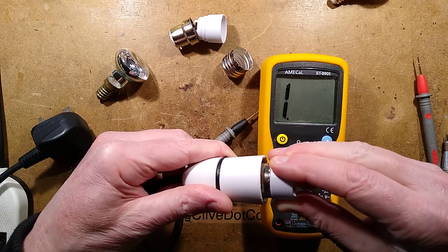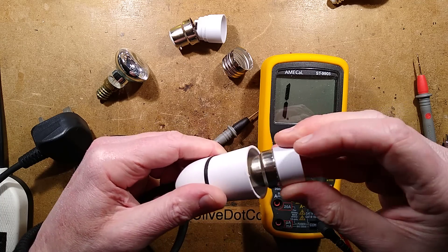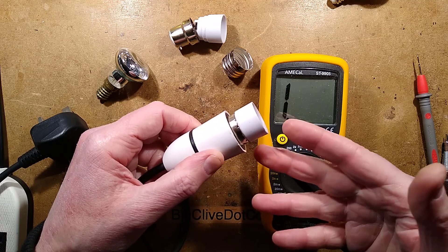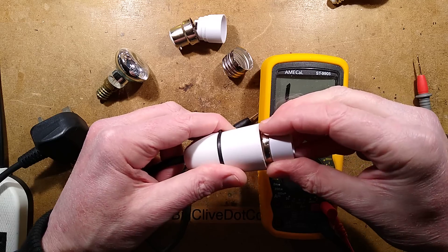Because in a traditional plastic lamp holder, when you put it in, that does stick out and is touchable. And because it's not polarised in any particular way, depending on which way you put it in, that will either be connected to neutral and be effectively at zero volts with reference to ground, or it will be at 240 volts with reference to ground, which could get quite spicy if you were trying to unplug a lamp.